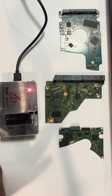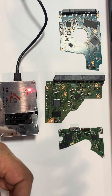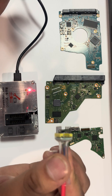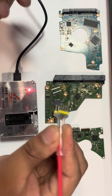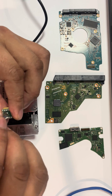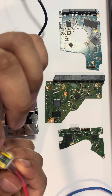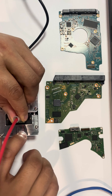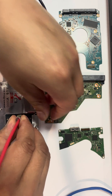Let's try the smaller size ROM chip read and write first. We need to connect this cable — this side goes to the programmer. We need to find out the direction. Here's the direction. Now push down to lock it.